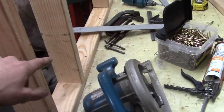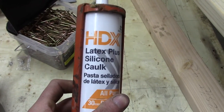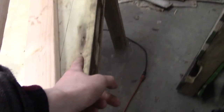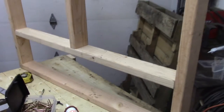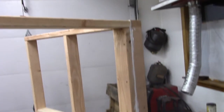The last thing — which I forgot to do on the front, but it's not a big deal — I'm going to really try to seal this up well. I got some latex-plus-silicone caulk that's good for indoor and outdoor use and is moisture resistant. I'm going to lay a bead down and then put the framed wall right on top of it to make a nice seal. I'll do that for all the joints and siding to minimize water entry, because water is a real problem.